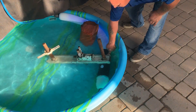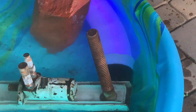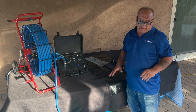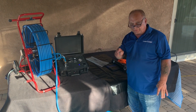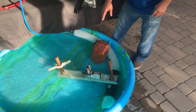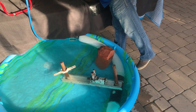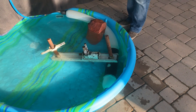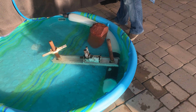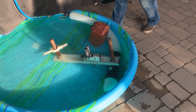You can hear that — that is solid. Five minutes. So after five minutes for this four-inch — less than three minutes for two-inch. We recommend six to eight minutes minimum for six-inch. So we switch off the lights. It's cold, there is no heat, but it would be cold because it's in the water. We switch off the air and go to vacuum, increase the pressure so the valve works. This will slowly pull out all of the air out of the device, and make a space for this unit to retract.